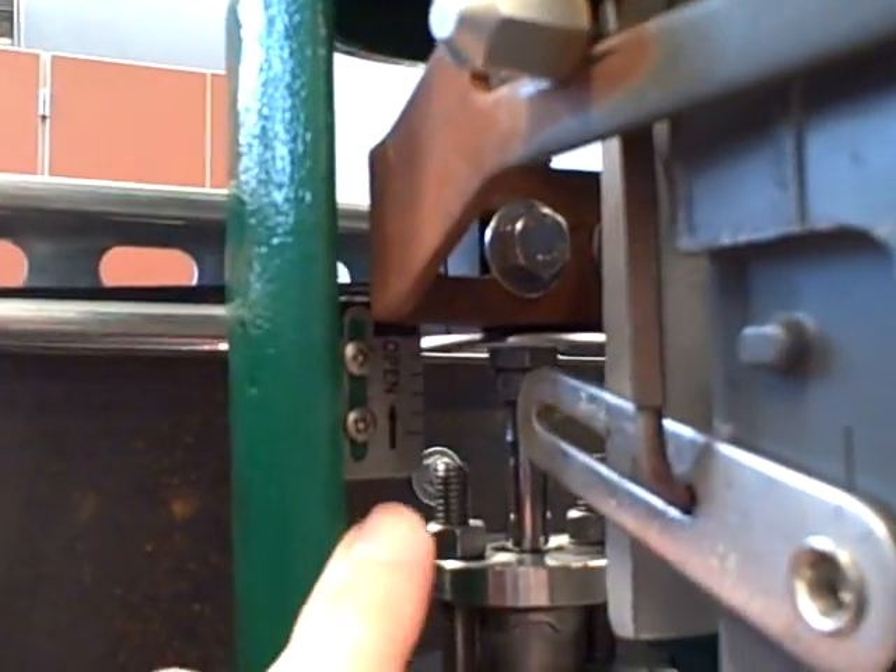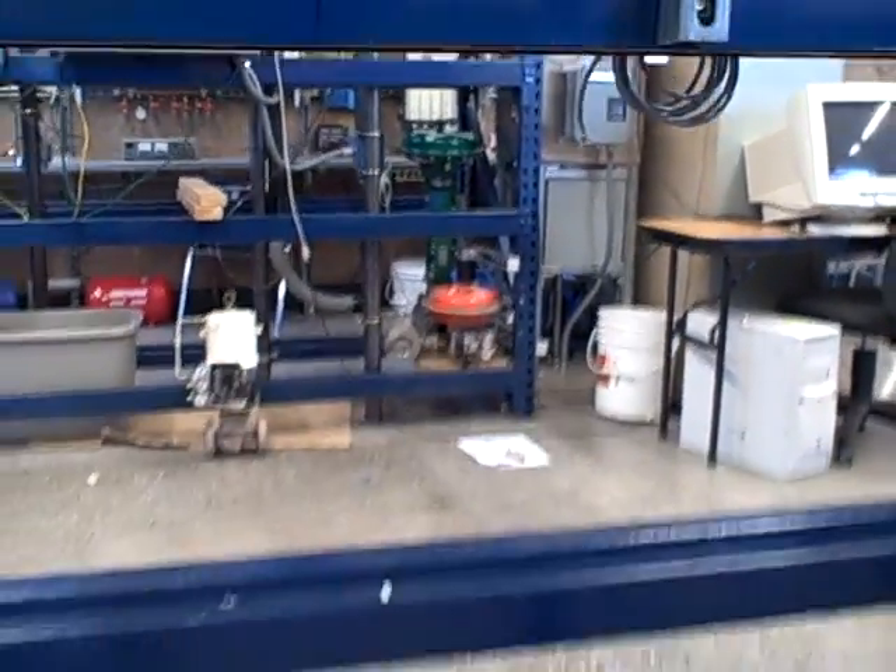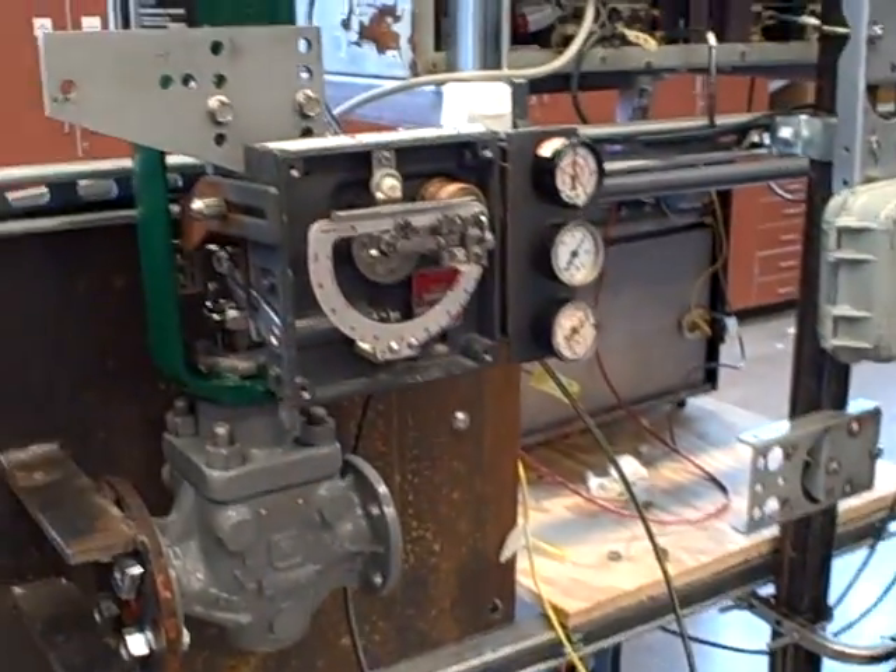Give me 100% now. At 100%, our E-body globe valve goes all the way open, and our rotary valve is all the way shut. So there is an exclusively split-ranged valve pair running off the output of a single controller.